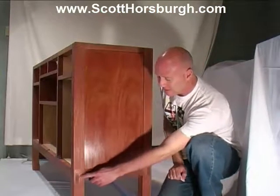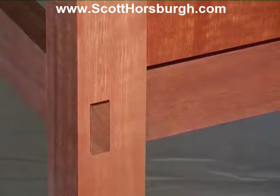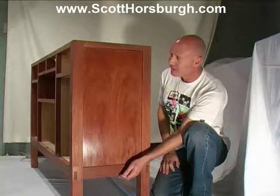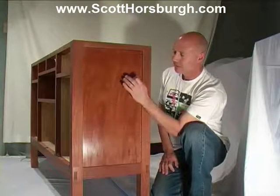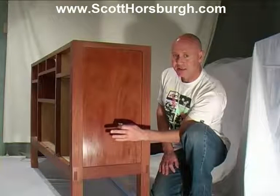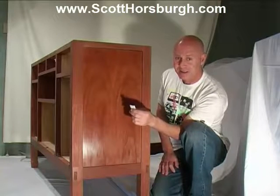You can see that the tenons, the long tenons at the bottom, come right through. I'm going to cut these flush prior to glue up and they will be wedged. When I have glued this frame and panel together, I haven't been concerned about the movement of the panel, so I haven't waxed the corners of the panel. I have spot glued all the way around, so that the panel is firmly fixed to the frame, and all I've been concerned about is wherever I was placing the shims, I didn't want glue because I wanted to just be able to pull these straight out once it had set.